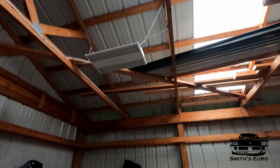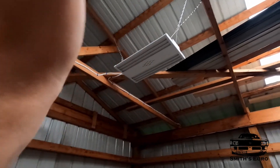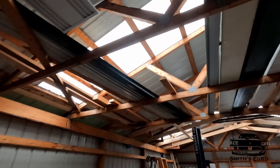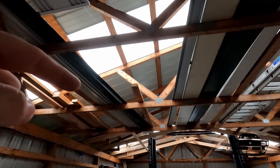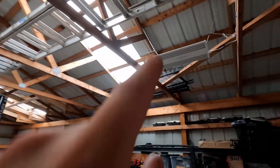Each light has its own two-pin feature, so I just add another wire into the second pin and it carries across. If I wanted another light, I could cut that wire, put one in, daisy chain it over. The connector is designed so that if one light dies, it'll still send power to the next one — it's a parallel circuit, basically. I have it run down to another junction box with three wires going in: one from power in, one going to the next set of lights, and one going across the beam.